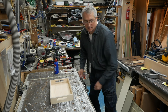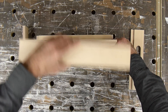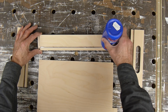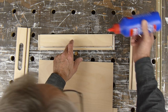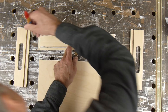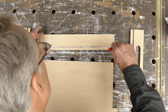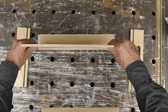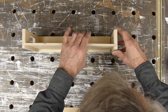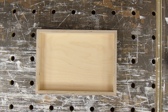When it comes to gluing these up, it's incredibly simple and straightforward — it really just slots together, just like the drawer boxes that I make. We run a bead of glue into the groove, squeeze at either end, and spread that out nicely with a brush. Repeating this around each side, taking care to have enough glue in the joints though not too much, before clamping it up tight and setting it aside to dry.